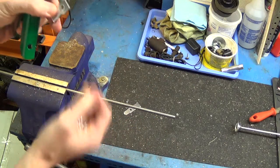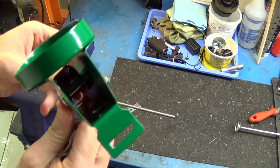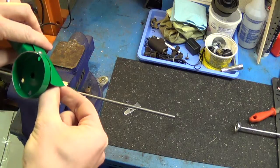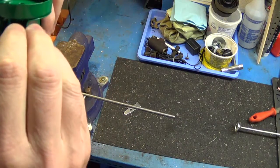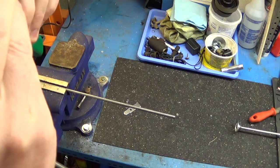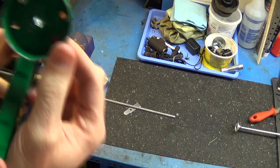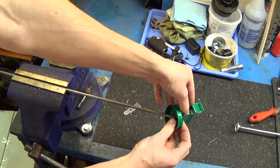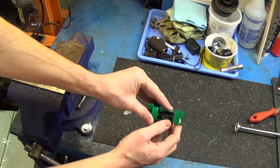This is the outer one and this is the inner one. Inside there's a little rod that goes across, and the inner plate will sit on the front of that rod — not behind it, but on the front. Take your spring and wedge it in between the two. Set it on the little plate and push it into place. When it's in place, you'll see it lines up with this hole and roughly with the hole in the rear. Take the large rod in the vise and put it through this internal spring, line it up with the rear plate.